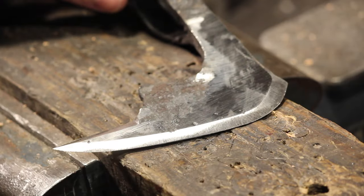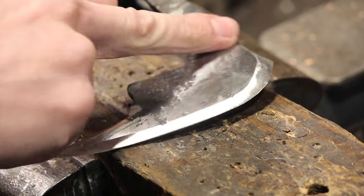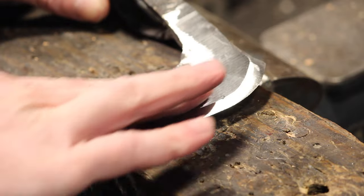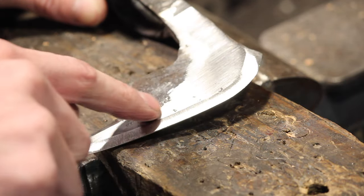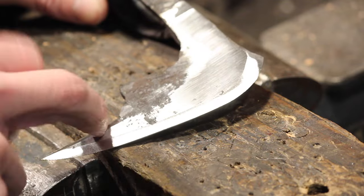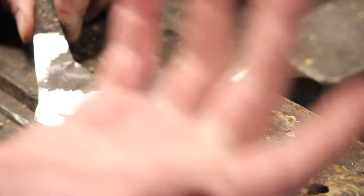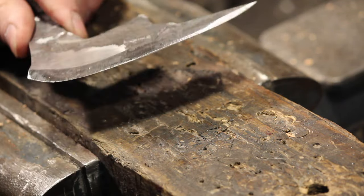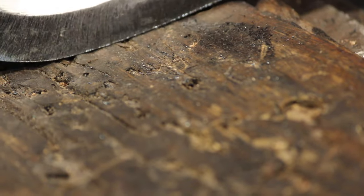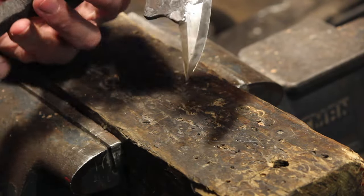I just took it to a 60 grit on the edge here and did a bit of a false edge on the inside of this primary beard. This end looks pretty good - I don't really see any weld lines, maybe in here where I couldn't grind it down enough, but that's the very end of that railroad spike head so that's kind of to be expected. The main body of the cutting edge seems good. On this side, obviously we have this big old line from the railroad spike head - I knew that going in, that just didn't set in the initial weld. So there's a bit of a line going down the edge, but I think overall we got a good weld and I'm happy with that.